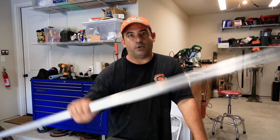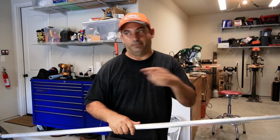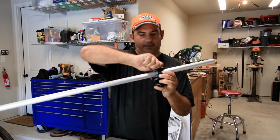Next thing you're going to need is some tubing. My grip head here allows for 3/4 and 1 inch tubing. I got the bigger one. You have to get tubing, not pipe, because tubing is measured on the outside diameter, whereas pipe is measured on the inside diameter. And you know what's exactly 1 inch OD tubing? Shower curtain rod. So I stole this from the upstairs bedroom, and you always want to steal it from the upstairs bedroom because then the wife doesn't find out you took it till hopefully before Amazon shows up with a new one. Anyhow, it fits in here just right, tightens up.